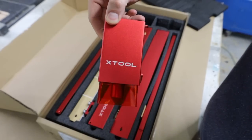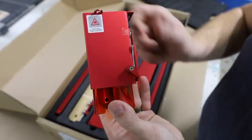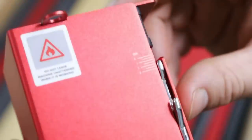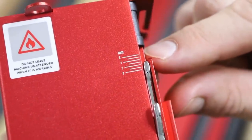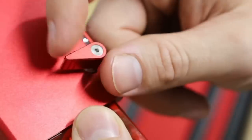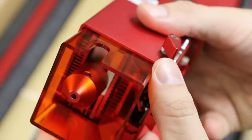Here we have it — this is the 20-watt laser head. This is a new feature that you will find on the Pro model. This little scale on the side here has some measurements for helping you get the depth of the laser cutting through the middle of the material, which will give you much better cutting results. I also like that they put these toggle tabs on here, which make for much quicker adjustments of the height of the laser head.